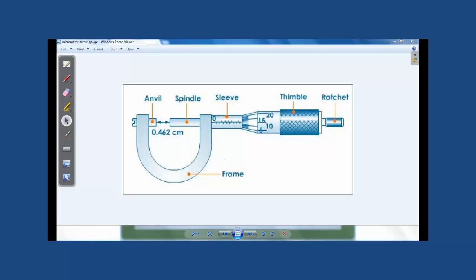The micrometer caliper is an instrument for measuring very small lengths using the movement of a finely threaded rotating screw, which gives it better precision than a vernier caliper. It is used in technical fields in which fine precision is required. Micrometers are available in metric units and US units. The metric one is graduated and read in hundredths of a millimeter.